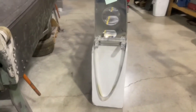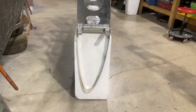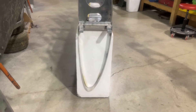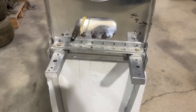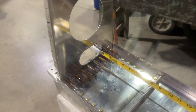Coming over to the left wing — the leading edge is a styrofoam leading edge that is wrapped and bonded with the aluminum skin, which gives it that nice pretty curve. This is the inboard side that mounts to the center section with the same mounting brackets and aluminum angle. This is rib number one, and I've got a cleco in place — the drill holes are drilled. This first one here is at 15 inches.